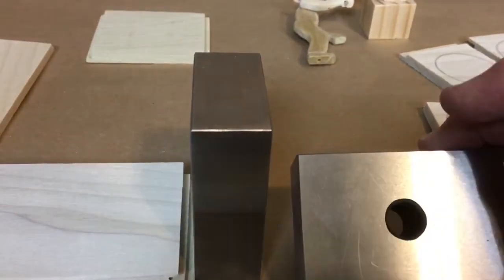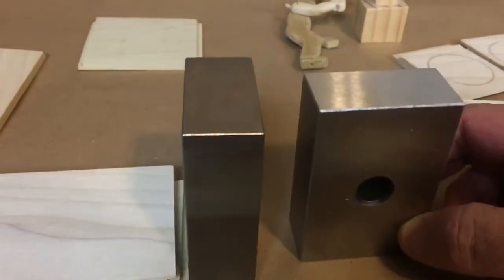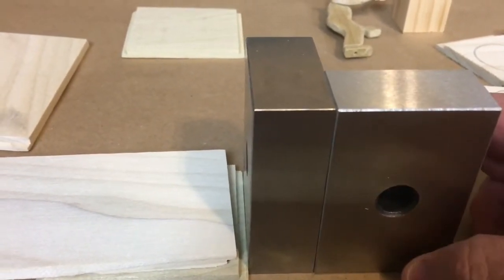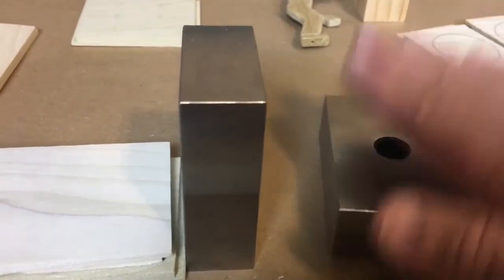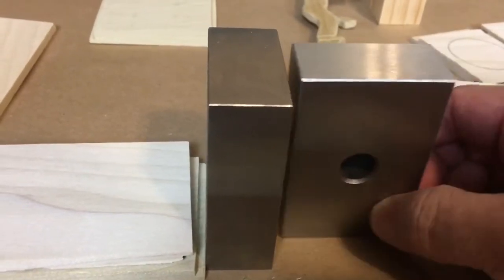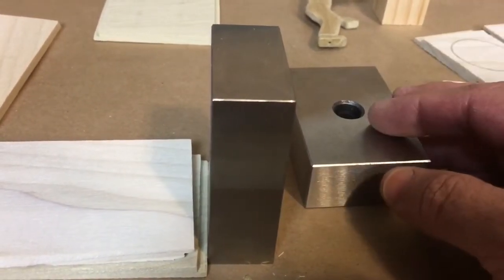You can rivet things on this. Like you saw, I have this piece of wood sitting up — it's perfect because these are precision ground. This is a 90-degree angle, a perfect angle right here. You can't get any straighter than that. Sometimes they call these machinist blocks because they put them on a machine table and work off them, either in a mill, a drill press, or whatever. It's flat — it's a piece of precision tool. If you've never had them, buy them, and then you can message me and say thank you, because once you start using them, you'll find out just how valuable they are.